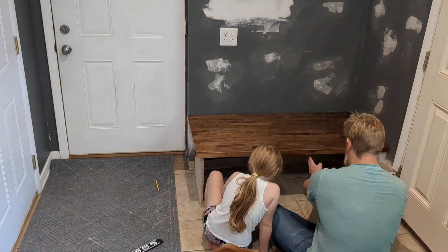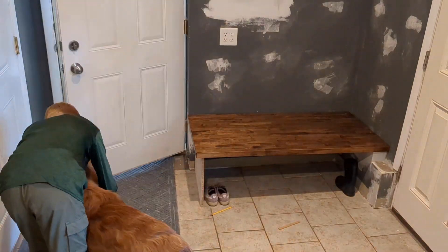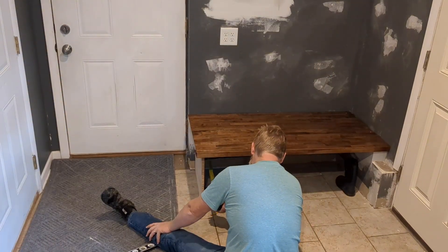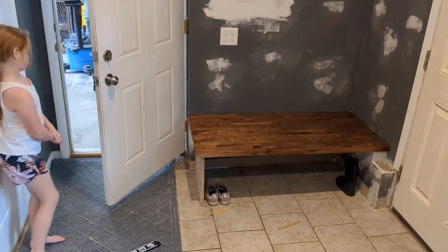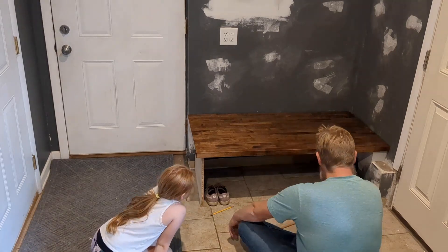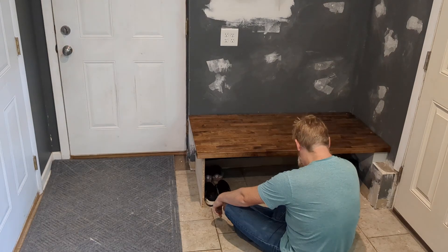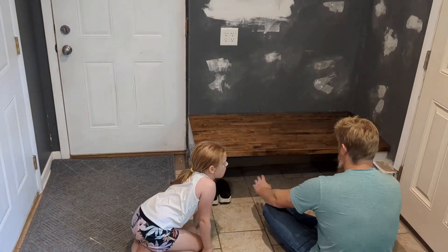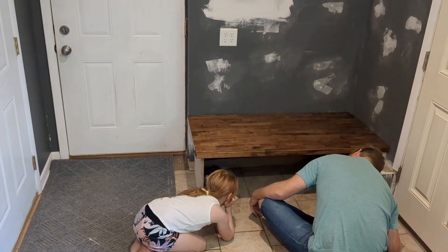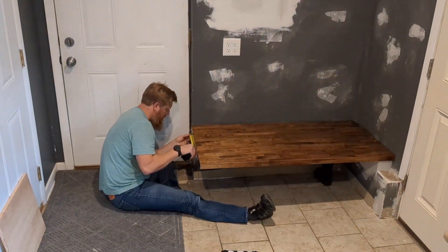Eventually I ended up getting out my laser level, which shot a laser that would travel below the butcher block and above it — really perfect for getting marks for the future of where the whole thing would go so that it lines up vertically and visually perfectly. It took a little while to remember that I had that and then put it to good use. I think it's the first time I've really used it for a project, so that was really handy. I may do a separate video on that — it's a really cheap one, the most inexpensive one you can get, but very effective, especially when you're trying to transpose a level line through something like this that's already installed.